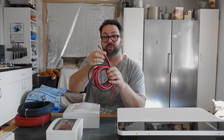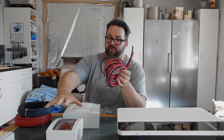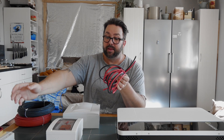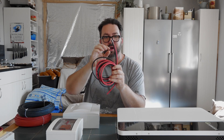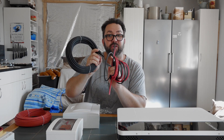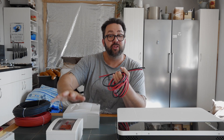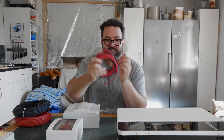I've got two metres of the 6mm stuff without any ends on it so I can strip those off. That will come from the breaker to the box here — the first thing it comes into is a disconnect, basically. That will come into a breaker with a surge protector. This stuff's got one plug on it that will be coming from the solar panels, and this stuff I can just bare the ends and wire it up. So we'll have wire from the disconnect to the breaker and surge protector, then from the surge protector and breaker up to the inverter — that's the PV side taken care of.